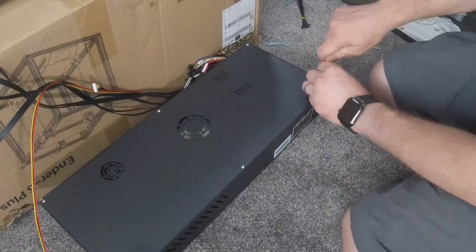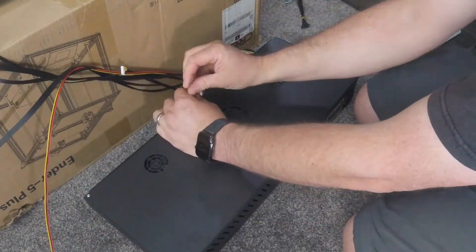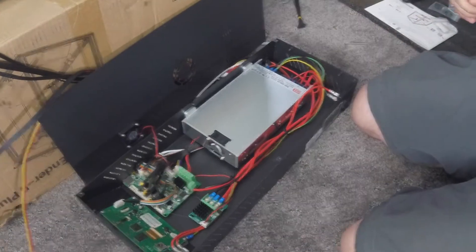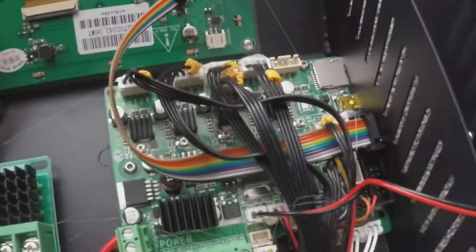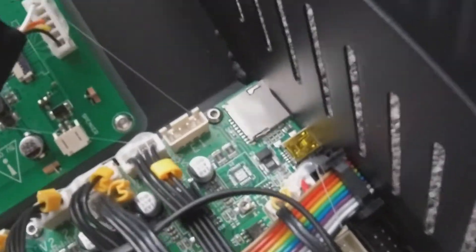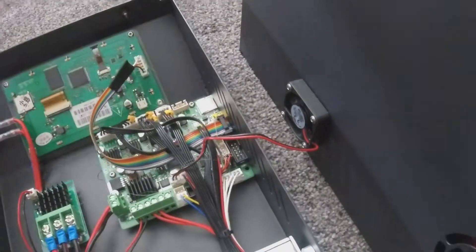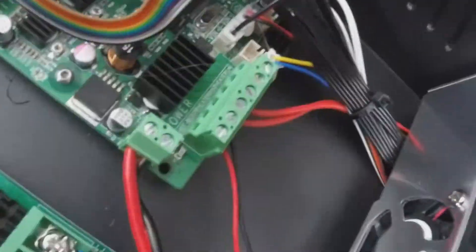So I figured while I could, it might be worth having a look inside the box to see what was in there. It was nothing of a surprise really — a board and a power supply, amongst other little fans. But the important thing was it was a Meanwell power supply at 24 volt. The motherboard is a version 2, I believe, with an Allegro set of A4988 stepper drivers on there. And again, you can't replace these unfortunately. There's a little dab of hot glue there as well, and the little board to the left is the MOSFET. Here's me just picking off the hot glue — it's not needed in there anyway. I think by now we all figured out that I was probably going to upgrade this board at some point in the future, so this is for reference.